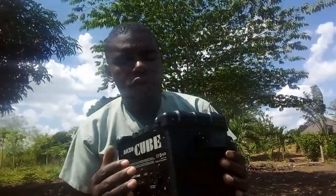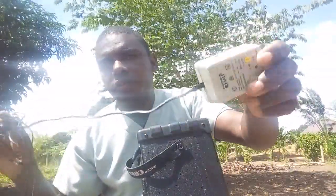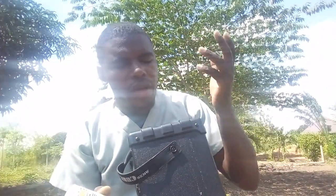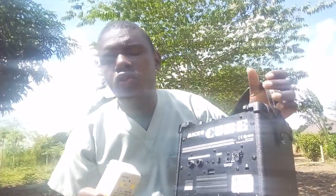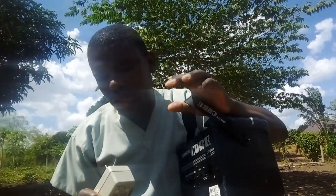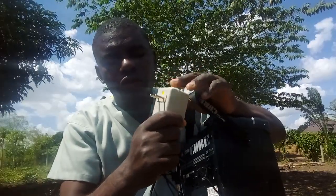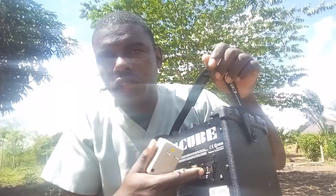need an adapter. And this is where I want to stress, because an adapter could be something like this. Here in many countries in Africa, I think, for example in my country, Tanzania, we use 240 volt power from the socket. I'm sure in the US they use around 110 to 120 volt. So if you are using it in America, the adapters could be straightforward because they are just 120 and go straight to the DC in.